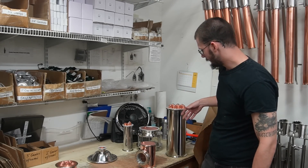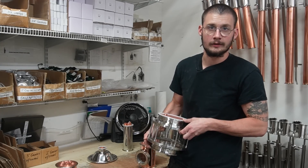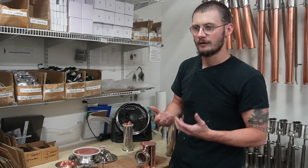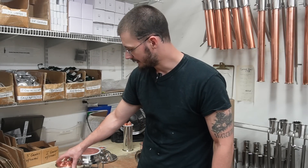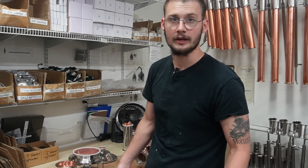In a lot of different formats you won't really be able to see the plates running — you can't really see through stainless. You can a little bit in glass or in a flute section, but you have to remember when you're distilling, all those hot vapors are coming up and this thing will eventually fog up. So when they're running, you can go off sound — they make sort of a water frothing sound. It's something you just have to experience. Bubble plates are going to go a lot more aggressive; we're talking some big caps as opposed to small holes, so they're making a lot more noise. That's a good sign — you want those plates to kind of jank around in there, you want to hear them bubbling.